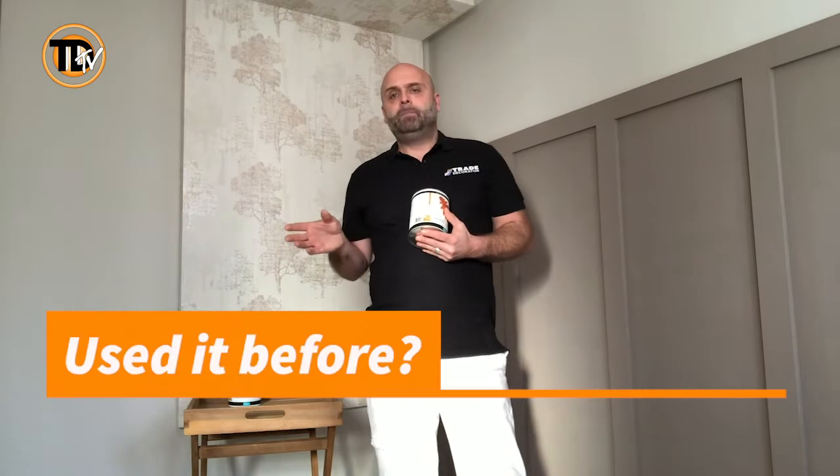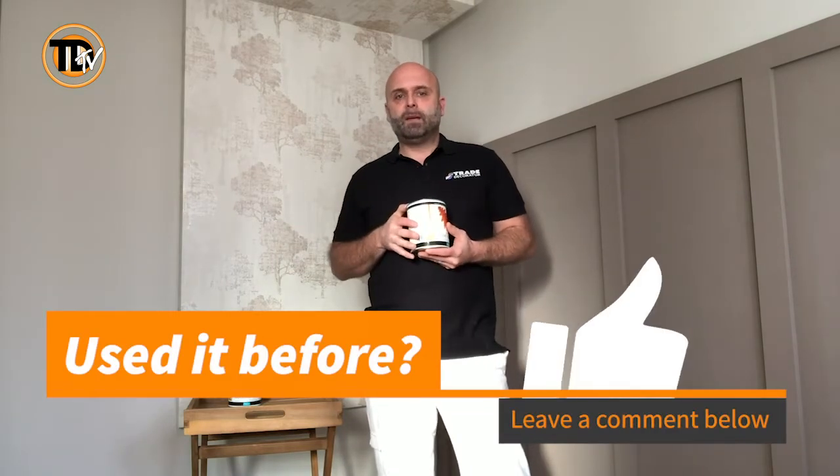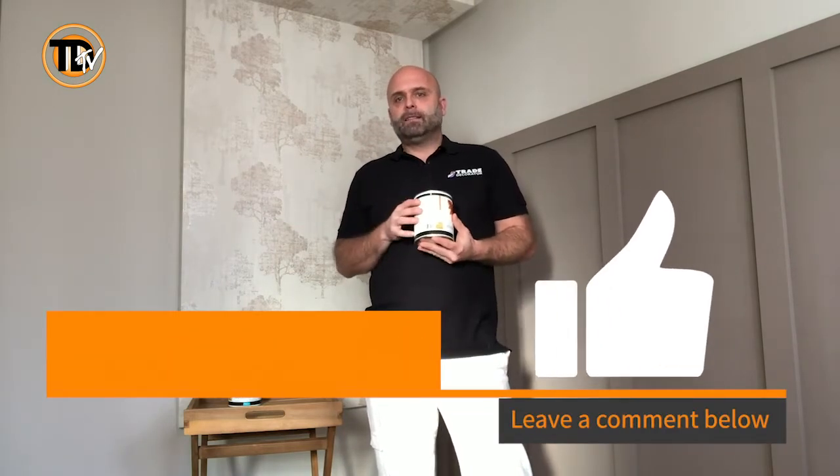For general application, it's for new wood, but I would probably degrease and give the new timber a light sand to get rid of any contamination, because it could have been sitting in a builder's yard for a long time. For previously painted timber, you need to strip all remaining paint from it with 60 to 80 grit sandpaper to get rid of the previous paint surface before applying this.